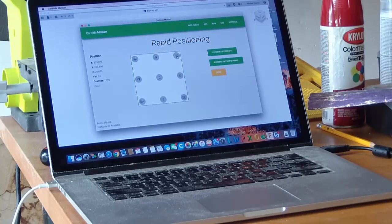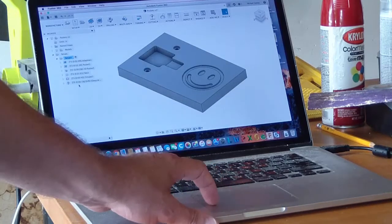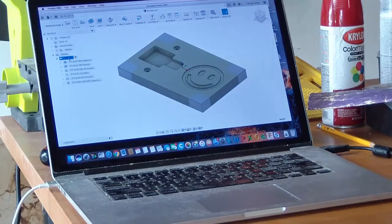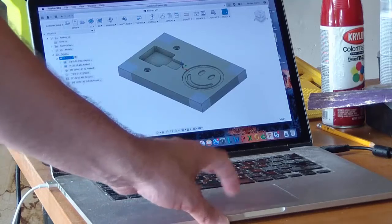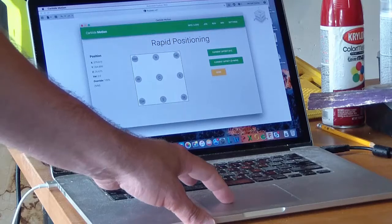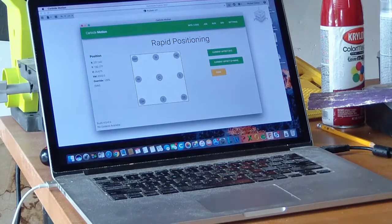I'm not going to use my touch probe here, just so I can show you the manual method of centering your object. First thing I'm going to do is just verify inside of Fusion where I have my XYZ. And we can see that our XYZ is located right in the middle, just like we've identified on our stock with the drawn X on the part. I'm just going to wrap it to the center. It's not going to be close to where I need it to be, but it gets me there quickly.